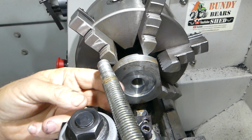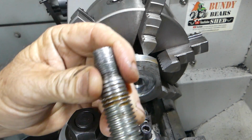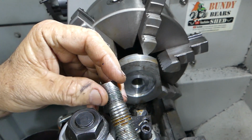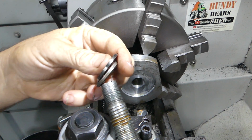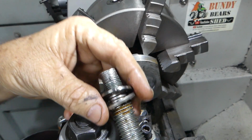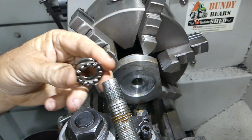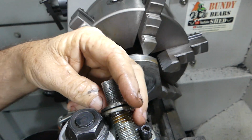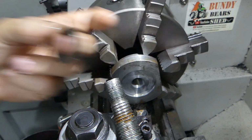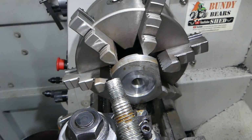the puller had a piece of 3/4 all threaded rod there, which was machined down to 5/8, and we had a 30mm thrust bearing down there. And for those who watched the Perkins AD4203, when I was pulling the liners out, one was just too tight and we buggered this bearing up. So I thought, oh well, not to worry, there's always room for improvement.